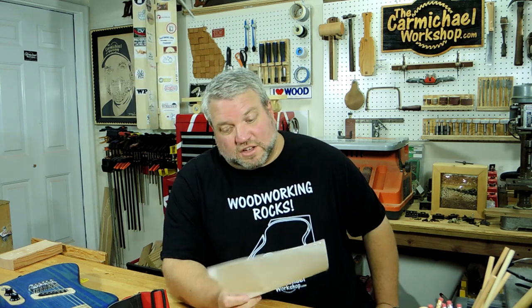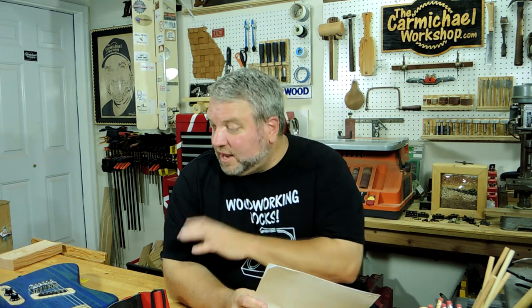Backyard Woodworks asked: 'Did you sit and watch the entire time, or did you feel confident enough to walk away? What was the longest you walked away for?' These were some long jobs — the body took six hours, the neck five hours, and the fretboard about four hours. I was able to do other things in the shop like clean up, but I checked on it every 30 minutes or so, and the X-Carve made it through every job with no problem. I was more concerned about my one-gallon shop vac, since I don't think shop vacs are intended to run for six-hour periods straight. Maybe a dust collector would be a better solution — if any of you have suggestions, please leave a comment below.